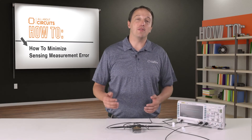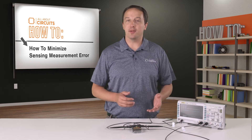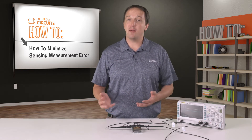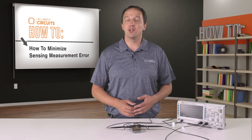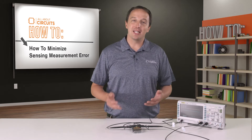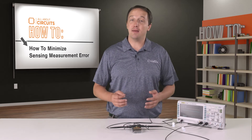In this video, we'll discuss the importance of op-amp noise performance in sensing applications. You might be working with an analog sensor for industrial equipment, monitoring current in a battery-powered device, or amplifying the output of a photodiode. All of these are sensing applications, and the noise performance of the op-amp has a big impact on the measurement's accuracy and precision.